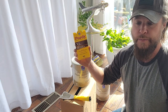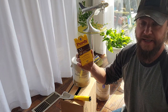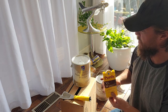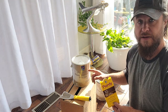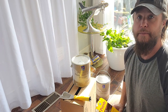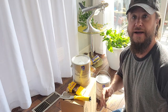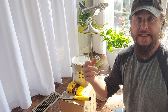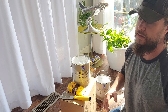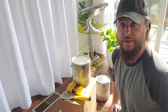If you get one that's too stiff, it's going to end up being a really thin finish with a ton of brush marks that go all the way thin and expose your surface. The point of this product is to not only adhere your peeling surfaces, but to also put like a candy shell on it. It makes your home like a hard, melt-in-your-mouth, not-in-your-hand piece of candy with a candy shell to protect it from weather. And if you caulk your home correctly, you've got literally a completely weathertight latex shell around your home.